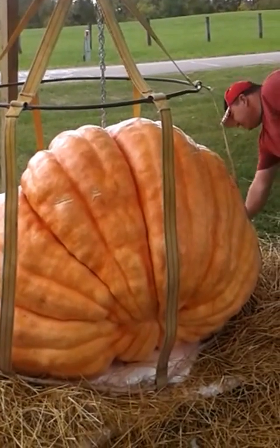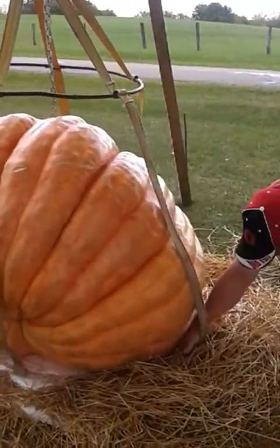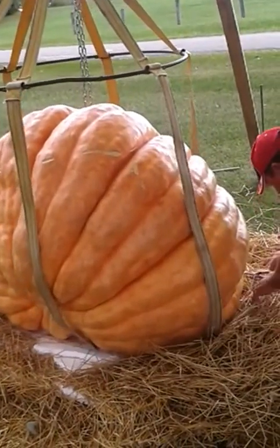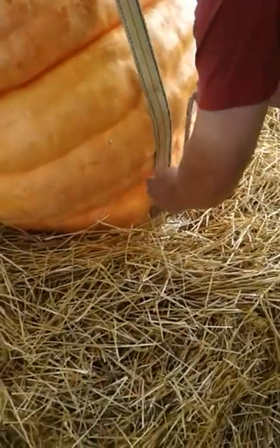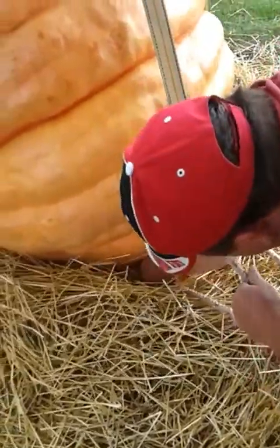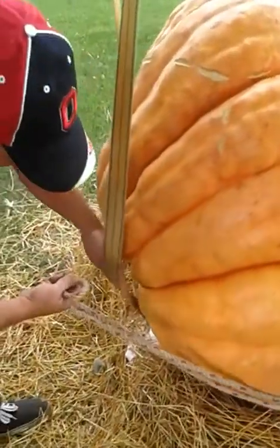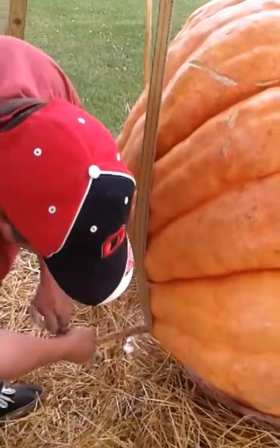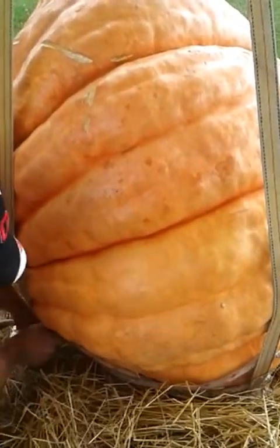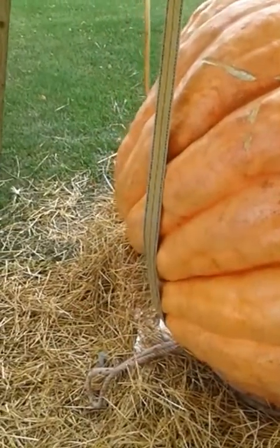Those are pretty even and the rope is down underneath, so we'll pull the slack out of the rope. Over here we can see on the rope — pull the rope tight. Once you get it tight, put the tail end behind that strap up underneath. If you really feel uncomfortable, you can put it behind the next one too. Then go around and make sure the rope's under it all the way around.